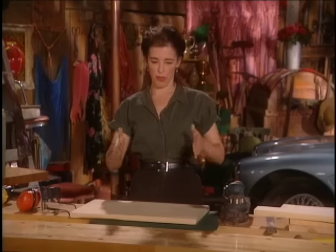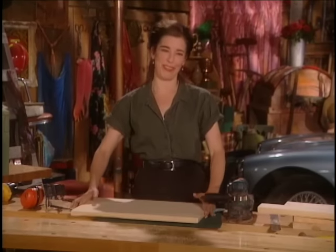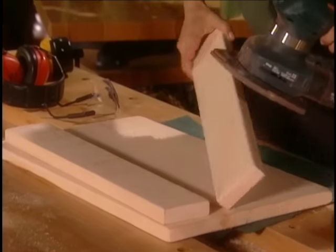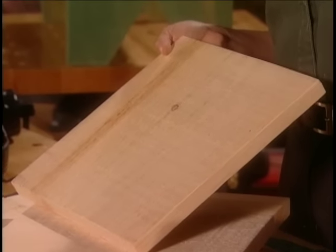The first thing to do is just cut out the wood. I'm using solid lumber, but you could use plywood if you wanted to. About 12 inches wide, unless you're making a really small one for a really little kid, then you might want to go with an 8-inch wide board. This one I'm making is 20 inches long — it's sort of a bigger bench. Then you build these little supports that go in here, actually an inch shorter than the seat because the seat hangs out a little bit. I've sanded all these pieces ahead because it's easier to work on the whole board before it's put together.